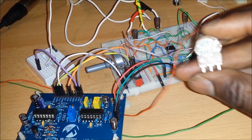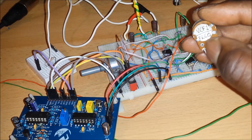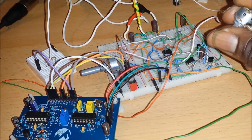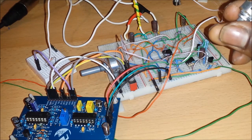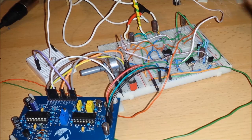So what I have here is positive modulation going in one side, negative in the other. When you turn the pot to about the middle position it zeroes out the control voltage, so it acts as a depth control pot as well. When we have positive and negative modulation we can flip the waveform around that way — I didn't have to have two different ramp waves, I could just use one ramp wave. So we've got a ramp wave, triangle, pulse, sine, and the sample and hold, also known as random.